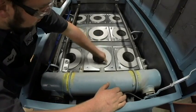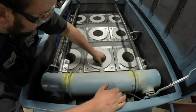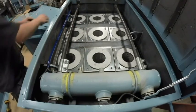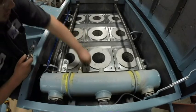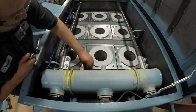The square tops are reusable and should last the life of the machine. Again, making sure the gasket is sitting flat, install the serrated nuts and tighten carefully and completely. After filter installation is complete, check every filter again before moving on.